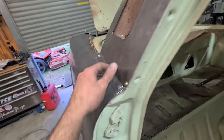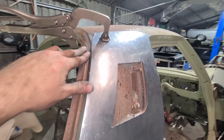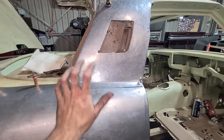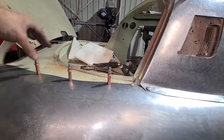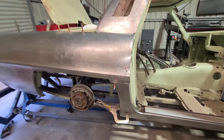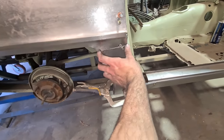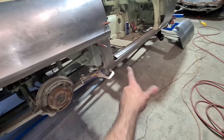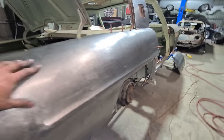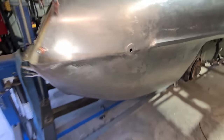This is going to fit nice now and I'll probably make this center section and get that all sorted so it's ready to weld into itself. I think I'll weld that to the quarter before I do this piece. I'm not quite sure — I might just tack it so I know I can take it off if I want. I'm going to leave this dog leg disconnected until very last — it's only about a 100 mil weld and I'll just leave that to avoid complicating things while I'm trying to wheel it. So I'm going to pull everything back off again, change the die, and wheel these areas for these joins.